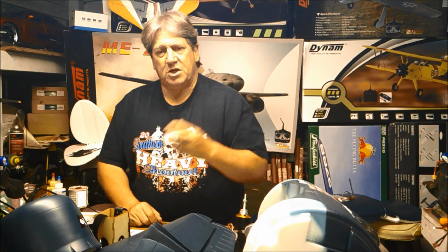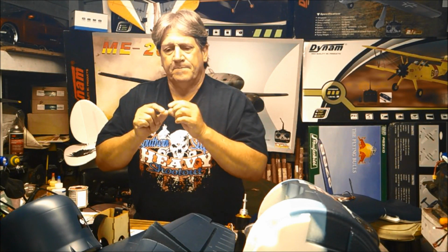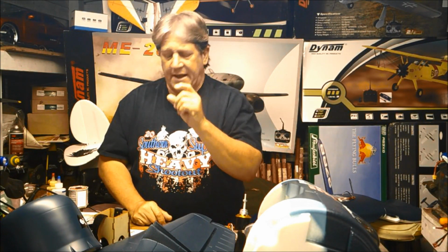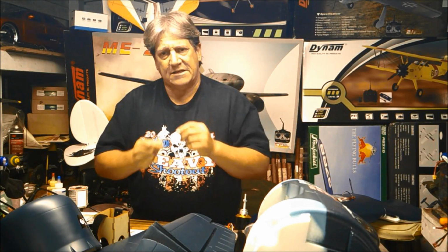These screws can't be super tight because they're a hinge. So you're going to just put them on to keep the pin in place, to keep the bolt in place. But I don't think you're going to want to tighten it up to have friction, because then the mechanism won't operate. So you're going to have to leave those loose, but you don't want the nuts to fall off. So you're either going to use the Loctite or some of this contact cement. I think the contact cement might work better.